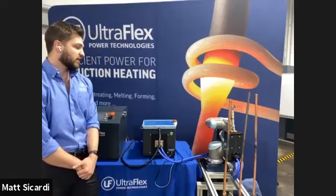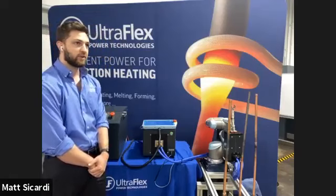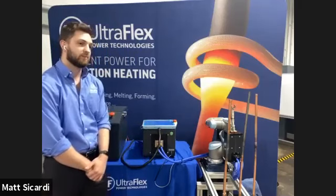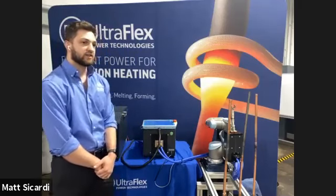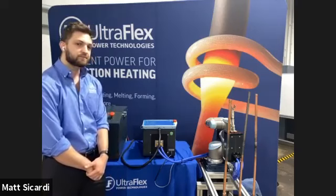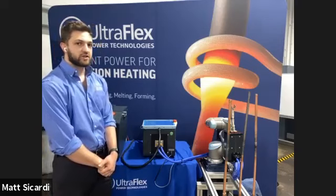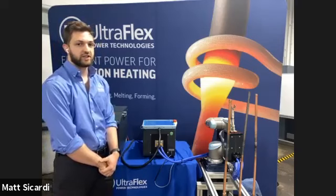So a couple key points about the flexibility of the automated Dragon 15 brazing system is that you're able to store hundreds of programs all in this Universal Robot pendant. This comes in handy when you're working with large manufacturing processes and you have lots of different configurations. You're able to assign a program to each configuration, and then you can fixture them as you would like, and the robot will remember the position-by-position based programming from every single cycle. As long as you fixture the parts so that you can present them to the induction coil the same way every single time, you're able to guarantee that the same amount of energy is put into the part every single cycle, in which you should see the same exact temperature profile across the parts every single time.